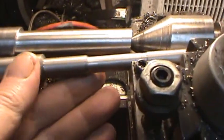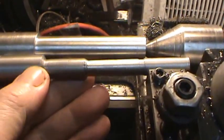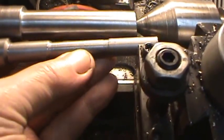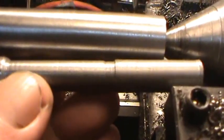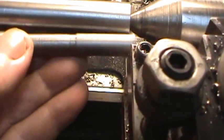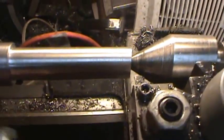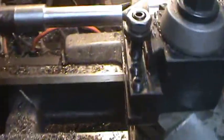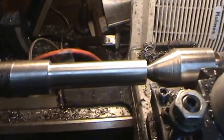by hand. I'm trying to make a shaft that fits better, and I'm trying to get all of the tolerance out of this lathe. But you can kind of see here that, I don't know how well this camera is even picking this up, but it's really not that good of a finish. Now this piece back here is one that I did by hand, because I don't have the gearbox on here now, so I had to feed this in by hand. What I'm doing is making a new shaft. I'll show you what that goes for.